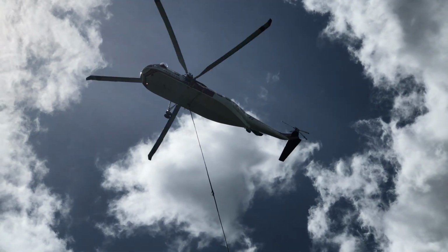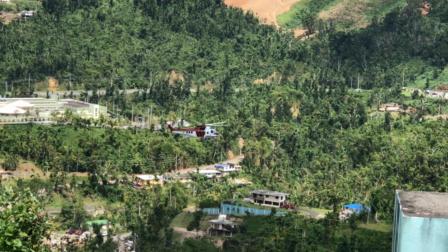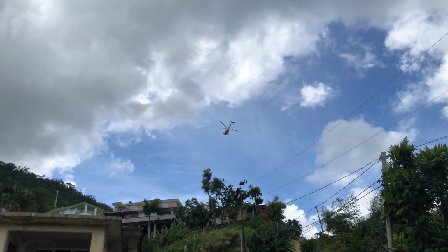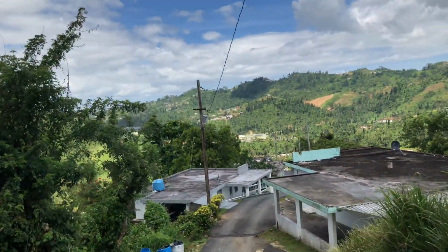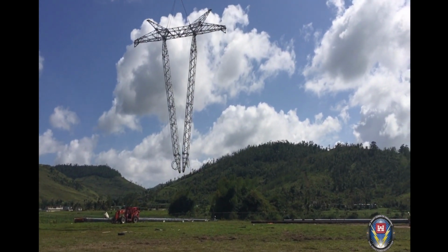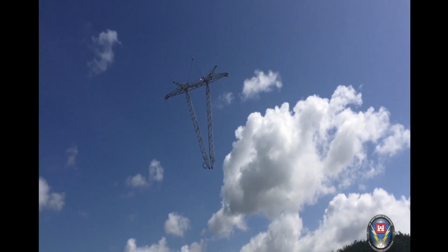We're in the mountains with extra helicopters that we brought in the last month, because we need that particular special equipment and some of the pullers that you use to pull the wire from pole to pole. The helicopters are not only setting poles, in some cases they're moving the linemen up to the top of the mountain because it's the quickest way to get there. We have cut access roads in certain places, so we've had to do the mobility work to cut an access road in some cases, but now we're trying to hopscotch the jungle terrain and come in from the top side with the helicopter, bring the men up there, they prepare the foundation, then heli-lift the tower into position, then a line pulling helicopter comes, and with an attached conductor, pulls it across the valley to that next pole.